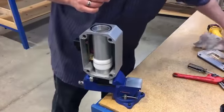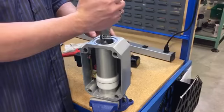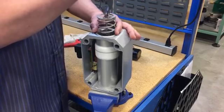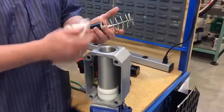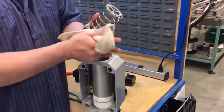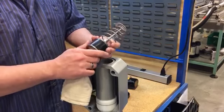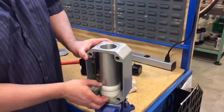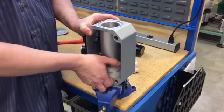Now, take pliers to help remove the cartridge for inspection of the meter. Make sure you do not damage the internal cartridge. By using a rag, you can wipe down the cartridge, making sure there is no debris or other magnetic particles on the magnet or any cracks. You can then at this time remove the enclosure if needed, if it's dirty.